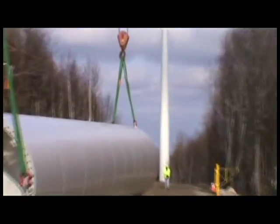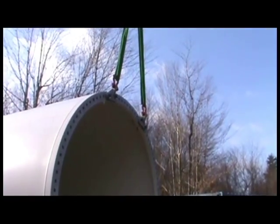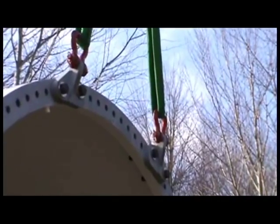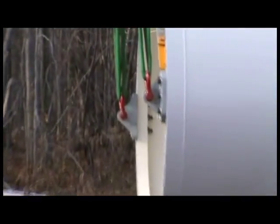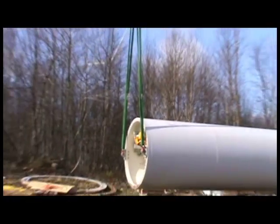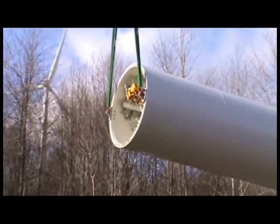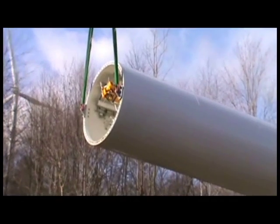The top tower section is lifted by two 20-ton lift brackets with two SlingMax TPXC 4000 x 20 foot slings and two S252 Crosby 20.5-ton web slingsaver shackles. The tailing brackets and slings are the same as used for the base and mid-tower sections. No snatch blocks are required during the tilt-up process.